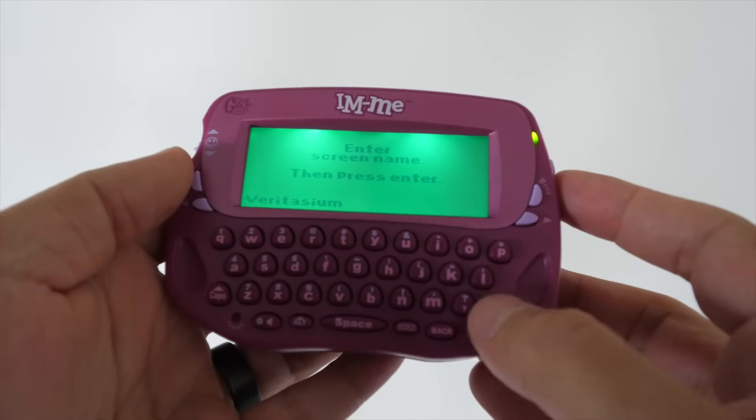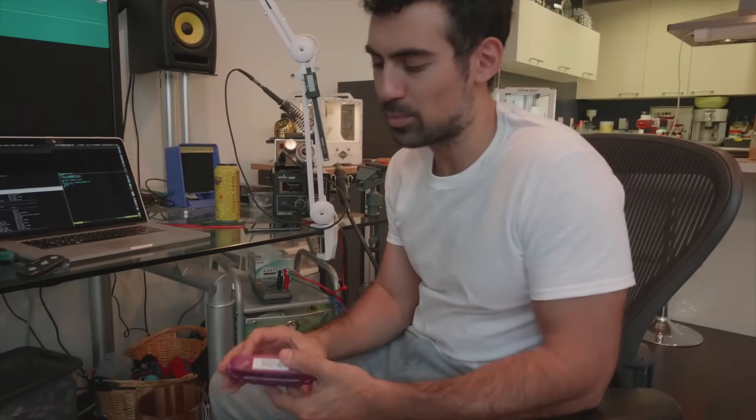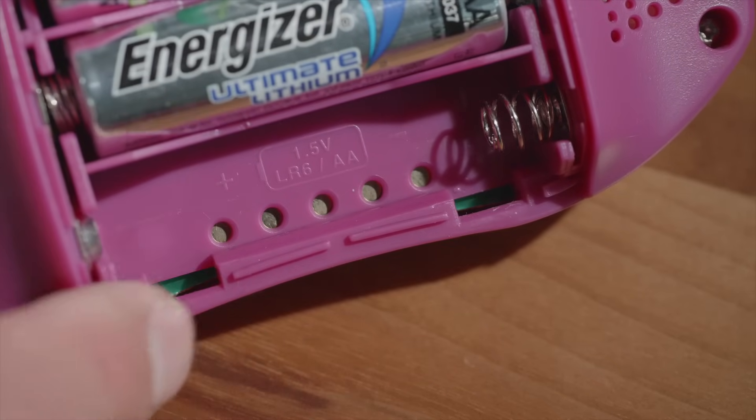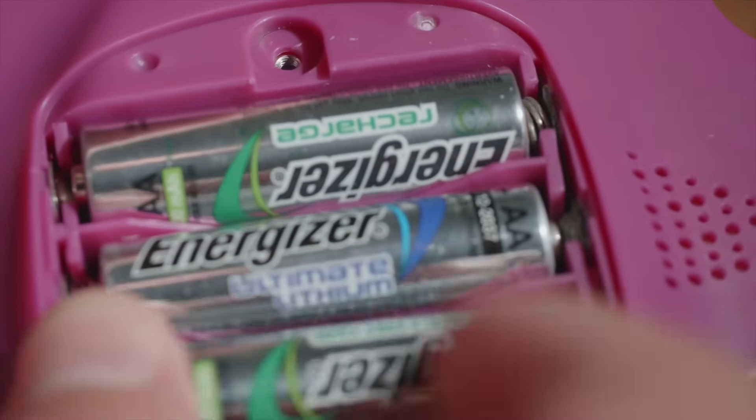So now we are really looking at a way that you could possibly brute force your way into any fixed code garage or gate, using a device like the IM Me. It's a toy from Mattel — I don't think they make it anymore. But some hackers out there found that it actually has a pretty cool chip inside called the CC1110. It's a microcontroller with a transceiver. The transceiver is really cool because it actually transmits and receives on a really wide range of frequencies, down to around 200 megahertz, up to like 950 megahertz. So you can talk to a lot of things, including garages, cars, power meters, alarm systems — all sorts of things are in those bands.